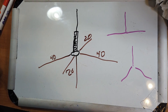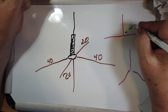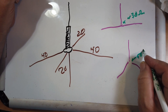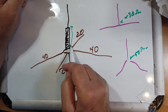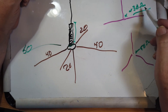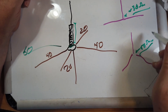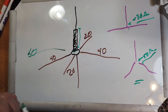Here's the quick answer to that question. When the radials come out flat, your input impedance here is on the order of 30 ohms. If you bring them down at sort of a 45 — doesn't have to be exact — you get closer to 50 ohms. Now, is it going to make a difference? You're going to tune this thing for resonance right here. So if this is only 30 ohms, it'll tune it so that it represents 50 ohms to your coax. In other words, putting these down at an angle is not necessarily going to change anything. This will make it a little easier to tune, but it's still quite tunable. You can play with this, but I don't think you're going to see much difference.